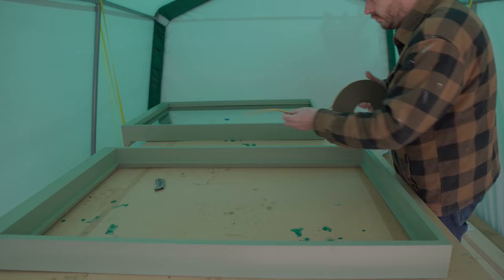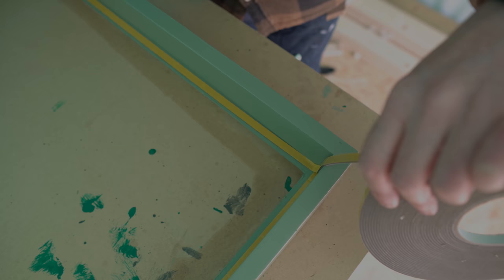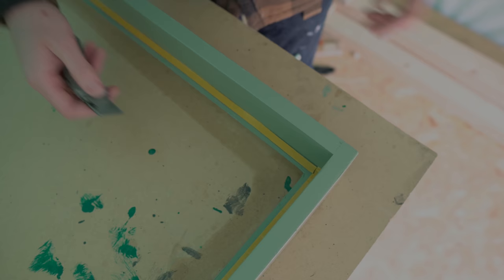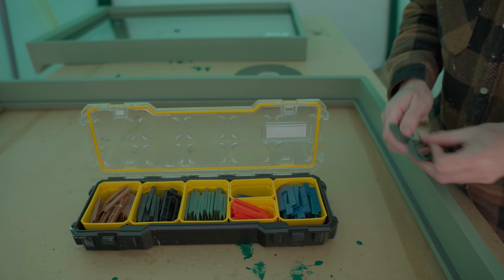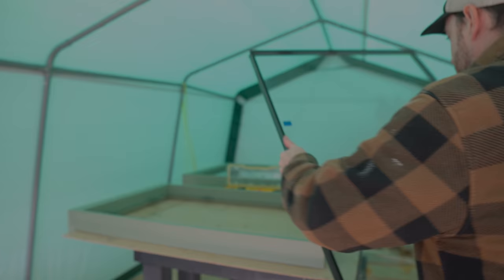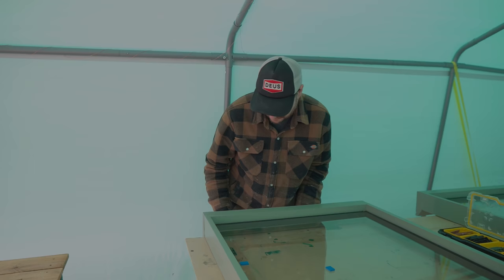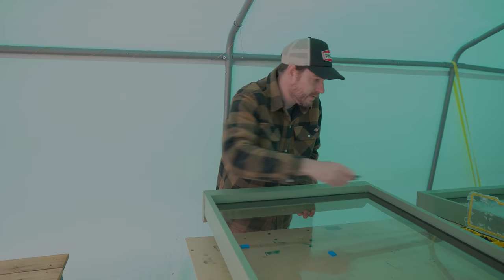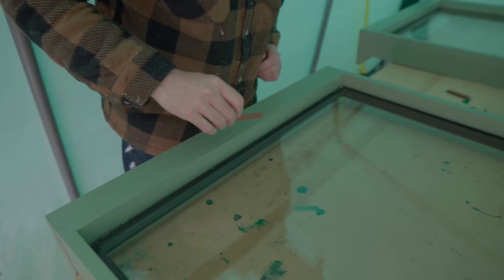The paint's dry and now I need to get the glass in. I've got this 2mm thick double-sided foam tape — learned about this from Bradshaw Joinery — so I get this installed on the inside of the frames. I put some 5mm packers in, lower the glass onto those, check I'm happy with the position, then remove the packers and push the glass down onto the tape. The packers are slightly thicker than the tape, which gives a little wiggle room to center the glass. Then I pull the packers out, push the glass down for a good seal, and cut a packer in half to stop the glass dropping at the bottom.